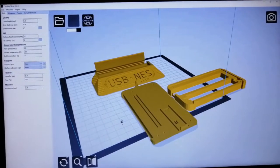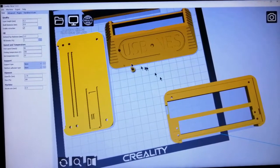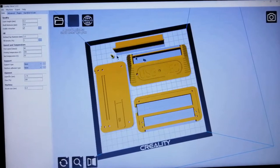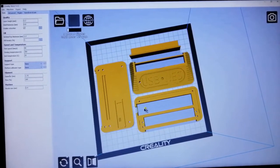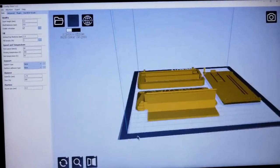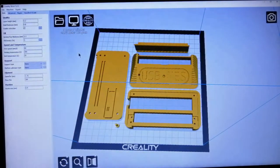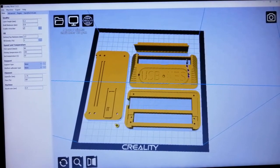Set top and bottom walls to 1.2mm. Use a 5% infill build for all prints. For PLA plastic, use 220 degrees Celsius to get the best results on the fine detailed lettering on the first print layer. Use a 52 to 55 degrees Celsius print bed temperature to minimize print flipping and curling. A confined printing enclosure is recommended for best results. This model does not require supports, so turn that off. When done with the settings, save your G-Code file and load it up on your printer.